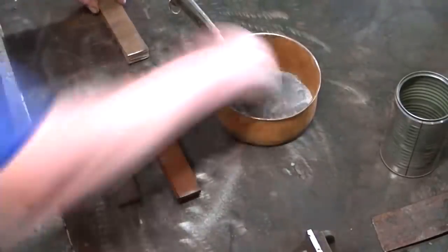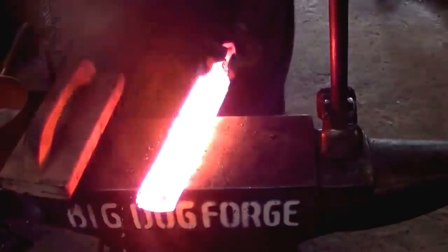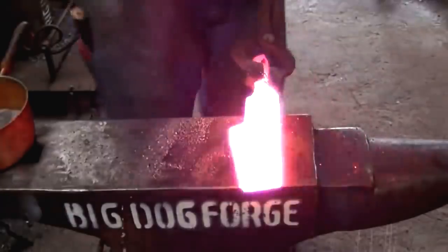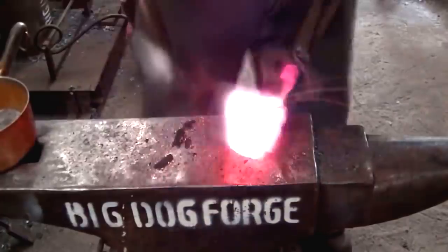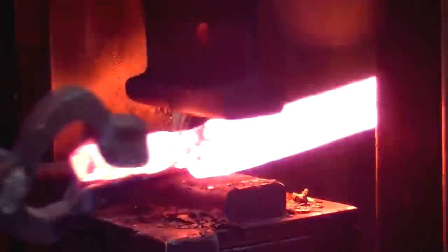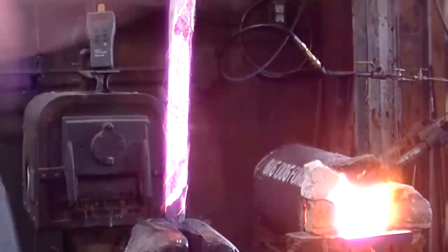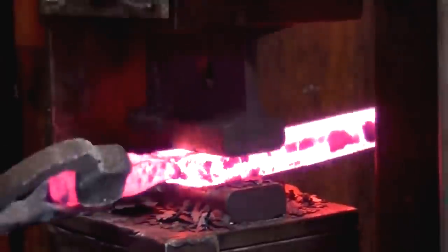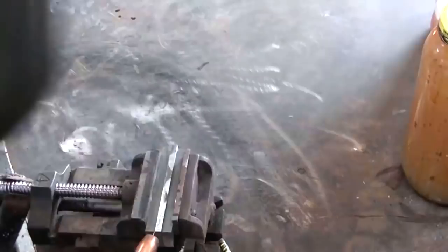This is the billet that we'll be using for the knife we're making today. This is a recap from the 200-year-old Damascus from a recipe, Bombay, India, 1824. It consisted of barrel bands, files, and cast iron powder. The steel was left outside to rust for 6 months. The rustier the better, as far as the recipe was concerned. We forge welded this and folded it several times to come up with 1800 layers.